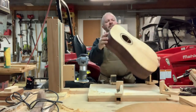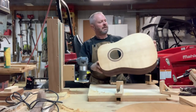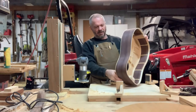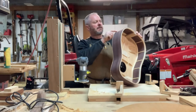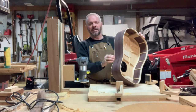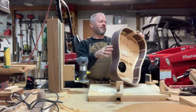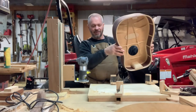Okay, you can see it's close-trimmed now. One thing to keep in mind — I noticed this the first time — is that the bearing that follows the body along does leave a shiny spot on the side of the wood. Last time I did more finish sanding before trimming, but this time I'm holding off. The only real finish sanding I've done so far was on the butt inlay, which I'll show you on my other guitar.